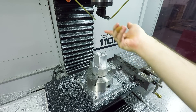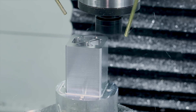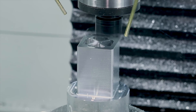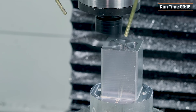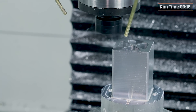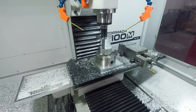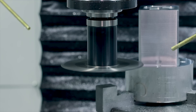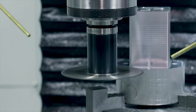Now we can come back in with the Superfly just to give that top a quick kiss and clean it up. Lastly for this op, I used a slitting saw to cut a relief around the base of the tombstone, which will help facilitate the final decking of these four faces that will be done on the Pocket NC.